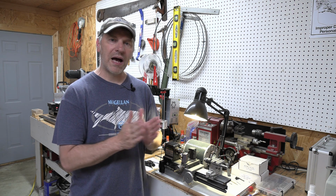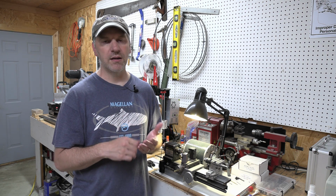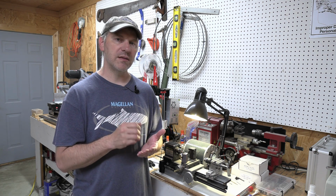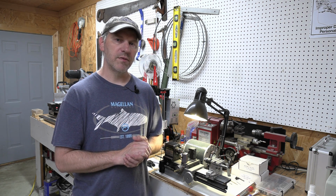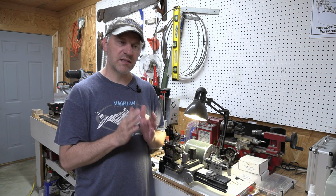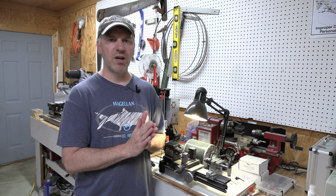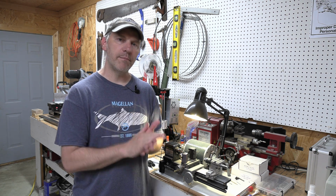But it is wide enough that I don't have to use shims when I'm putting the knife together, so I can just peen the knife together, peen the pivot on both sides of the knife, and that 1/1000th of an inch differential between the pivot bushing and my blade keeps the blade from binding.